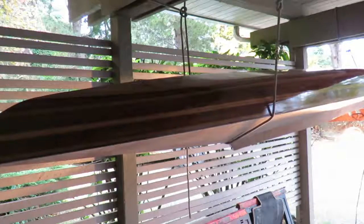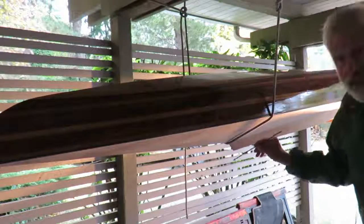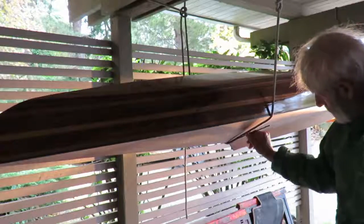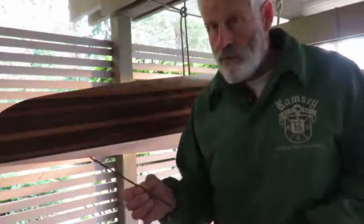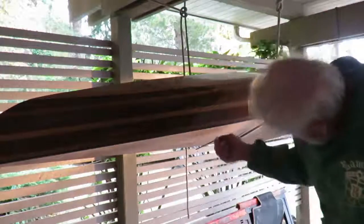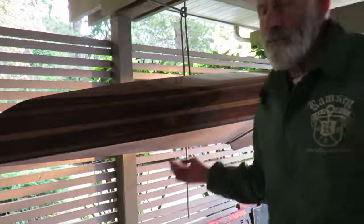We've cut those rods already, and that's the solid carbon fiber rod. It's going to come inside the boat, on the inside, not the outside, but it's going to come right to the front edge of the cockpit coaming, right like that. So you can measure on the inside. I think 10 7/8 is what we decided on this longer one. And then the shorter one is 8 inches exactly. And that'll go farther forwards, right up in this area, about in here. And again, goes from the shear straight towards the center line.